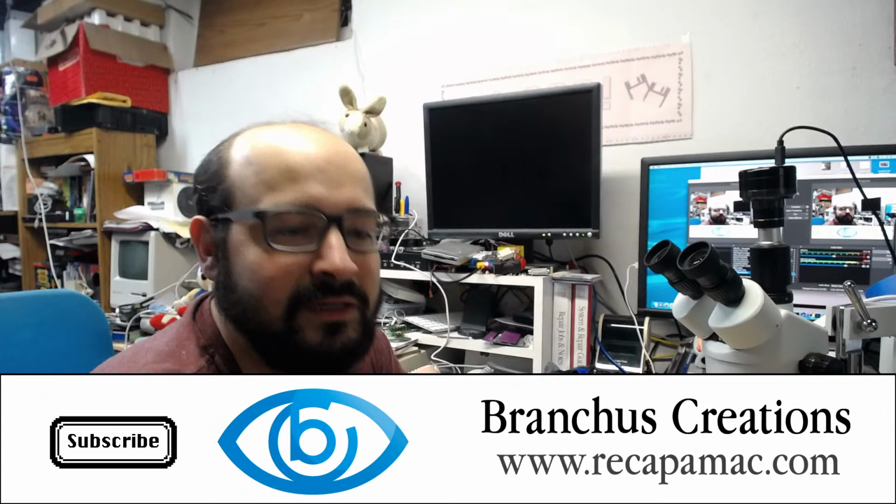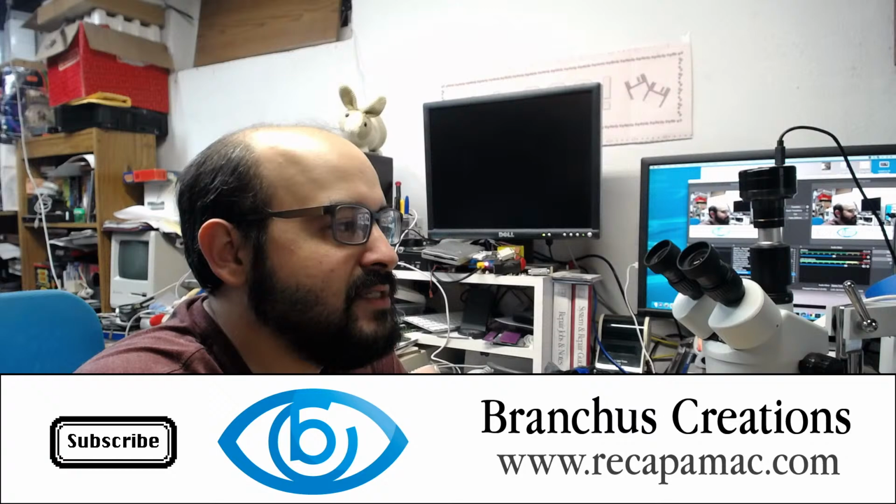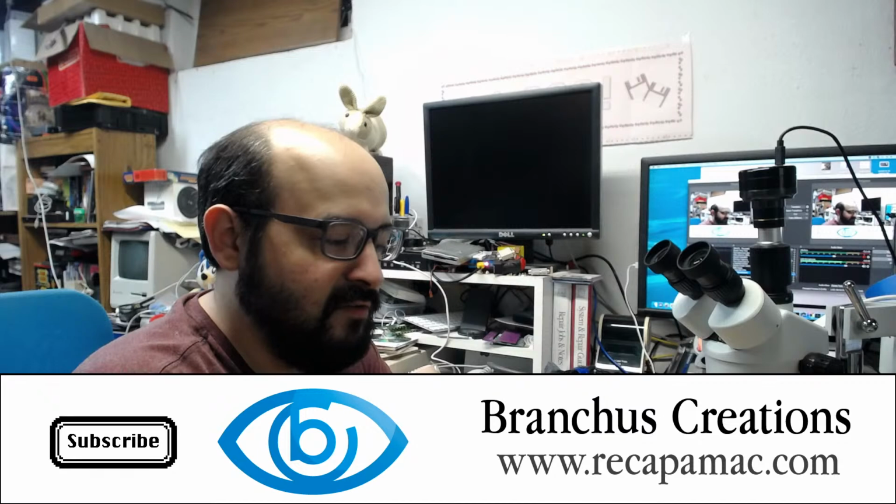Because the analog board is what's going to need recapping on that. Probably not anything to do with the logic board itself. And that's a little bit tricky. So recapping means removing the old capacitors of an item, let's say a computer logic board or whatever, and putting new capacitors on to that logic board. So you're basically removing a component and replacing the component. So it's shortened to be recapping.